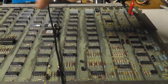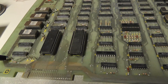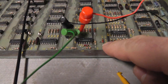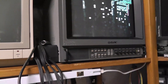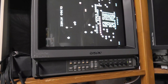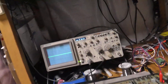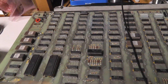I'll hook up color and maybe test the no-op adapter with signature analysis on just the 6502. For some reason R73 has been removed on this board, but holding sync I do get a picture. The colors don't look right through the camera but they do look correct on screen — kind of a teal lettered background with pink and teal outline on the mushrooms. Everything looks good. I don't get it — it wasn't working and now it is.